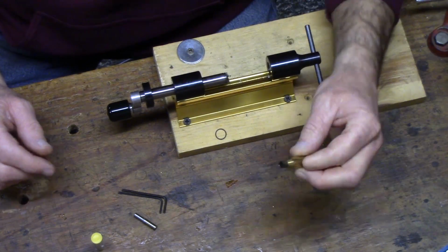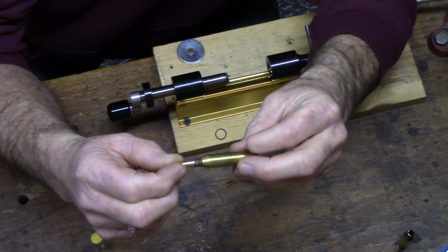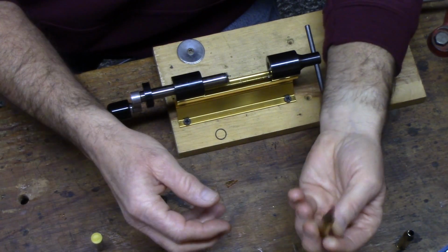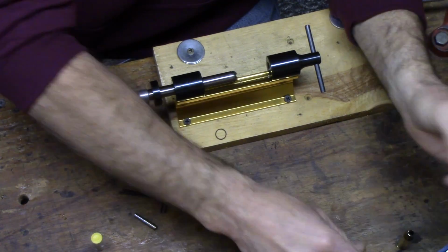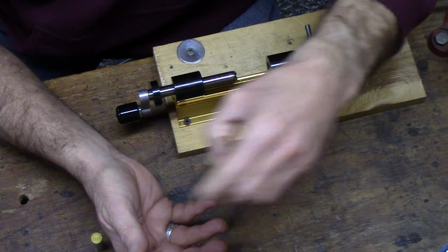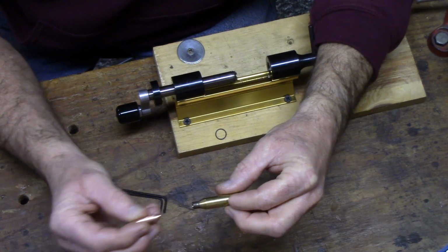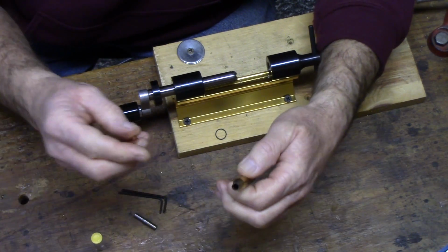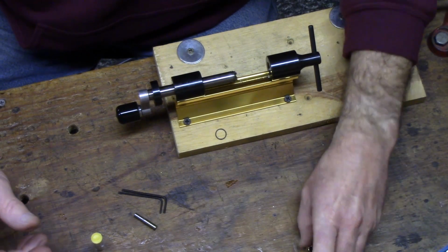That's the philosophy. Easy test: just see if it will grab a bullet. This is Hornady brass. It's super consistent. Probably as good as anything I've ever picked up that I've played with in 45 years of doing that. Some of them just have a little bit. And the philosophy of turning is to give that bullet no resistance. Once it's blown and it starts moving, it's got a perfect release on every shot. Consistency is accuracy.